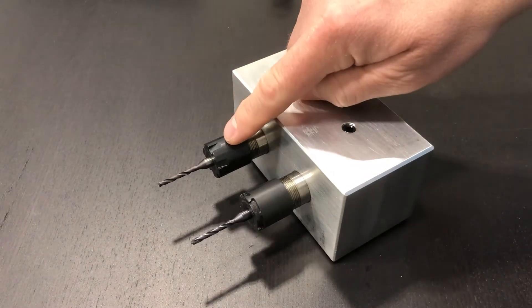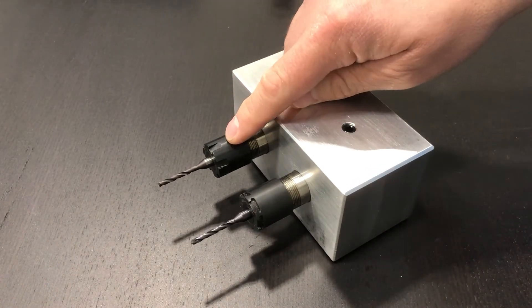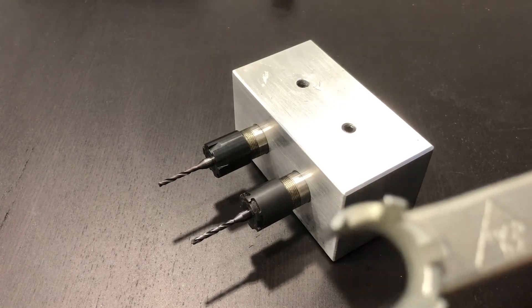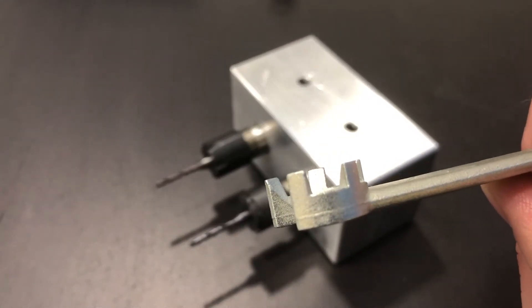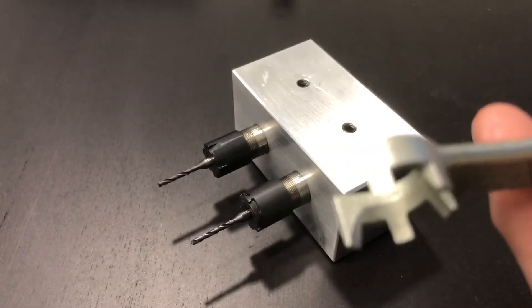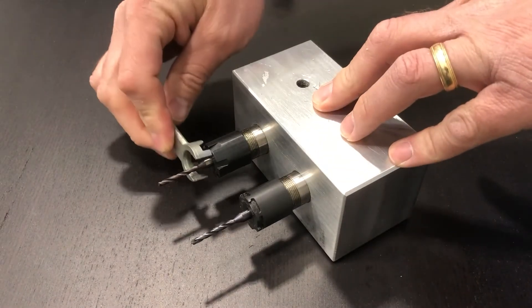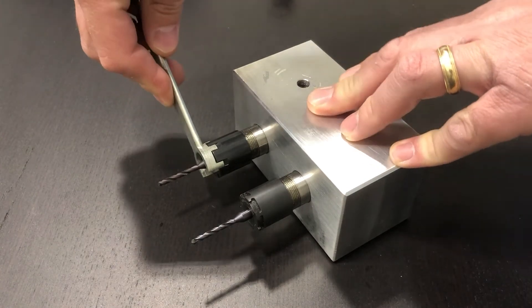Let's first look at the standard mini nut. The standard mini has been around since 1974 when RegoFix invented it, meaning this profile and the wrench combination have been around for over 50 years. If we look at the wrench profile used for the standard mini nut, you can see it is just a simple wrench — no locking on that at all — and it simply slides over the top of the nut itself with no locking system.